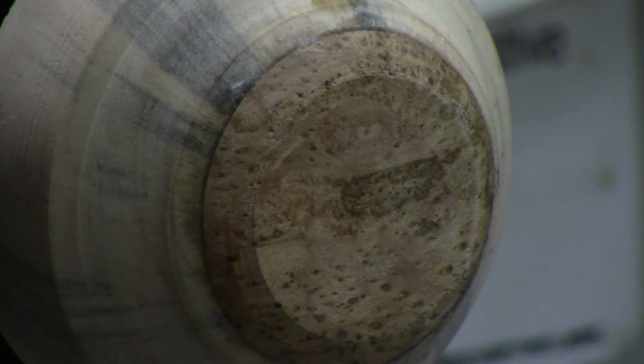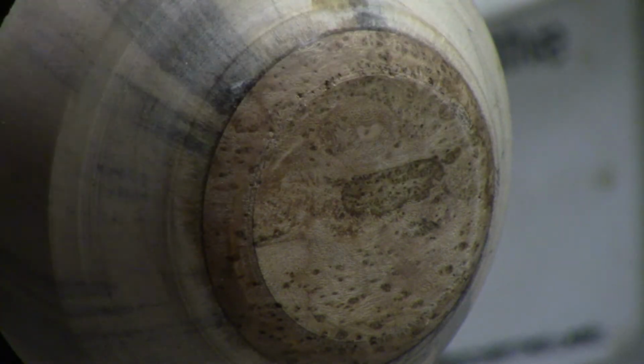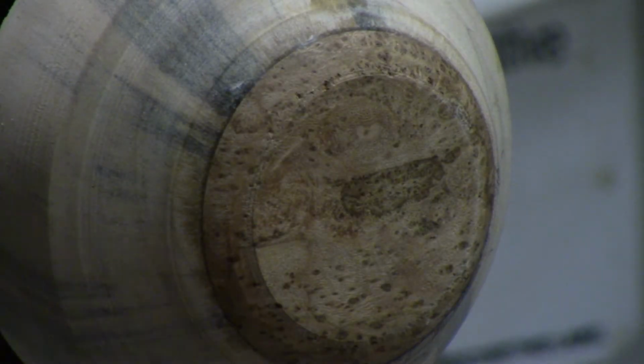Now you can also glue up 2 of the same color if you want it thicker, without buying the thicker one. Now a thing to know is CA glue will come through this veneer. So if you think you're going to hold it on like that, your fingers are going to get glued to this veneer. If you do it on the top, it's like you have colored fingernails, and that's not so bad. Unless you're a guy, maybe. But it will come through. So you need to plan to put it on with another piece of wood, your next bigger piece.